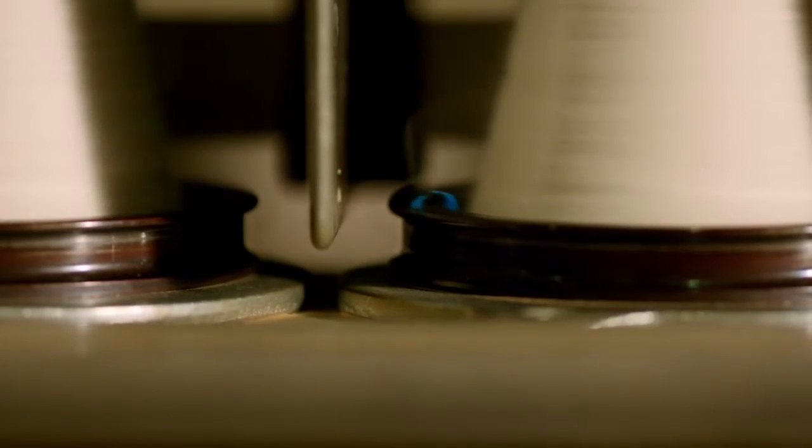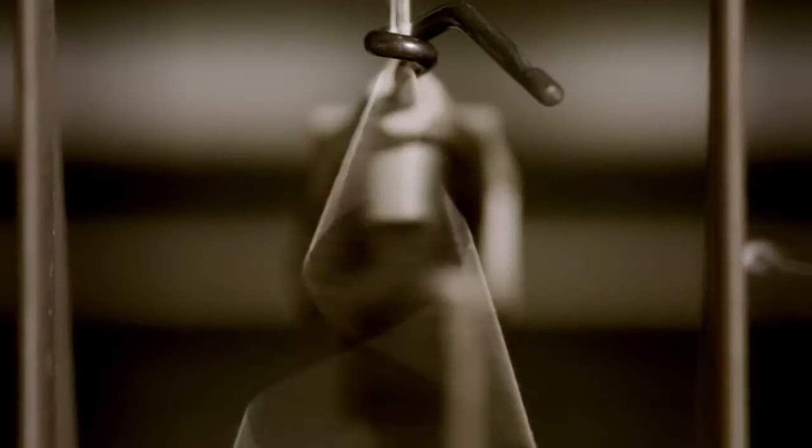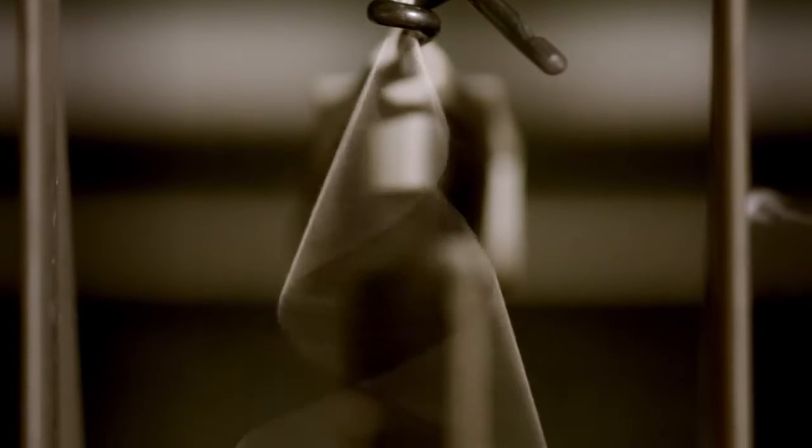Ring spinning fell briefly out of favor during the 70s, with the advent of a new method called open-end spinning, as Mr. Candiani explains. The advantage of open-end production is that the process was much shorter, with higher productivity and lower cost. Open-end yarn is formed in a rotor through centrifugation. The difference with ring-spun yarn is that the process of open-end spinning doesn't use twisting, thus making the yarn weaker and more even. Less interesting.